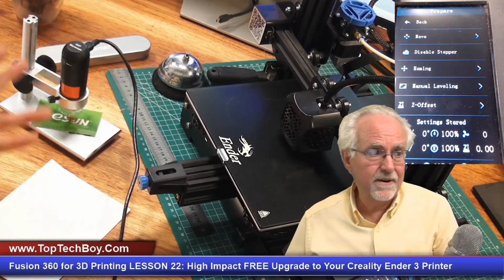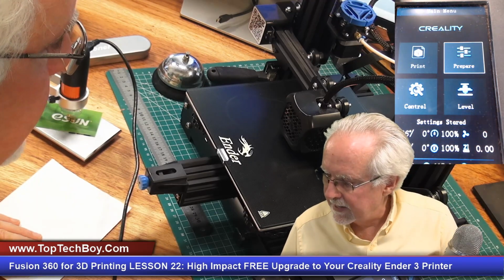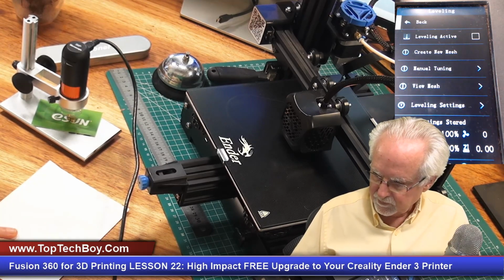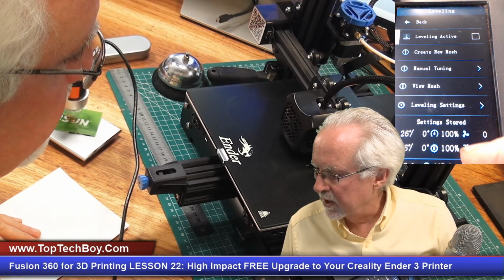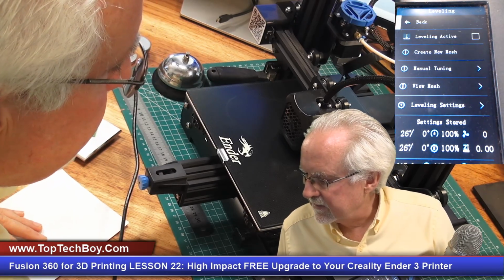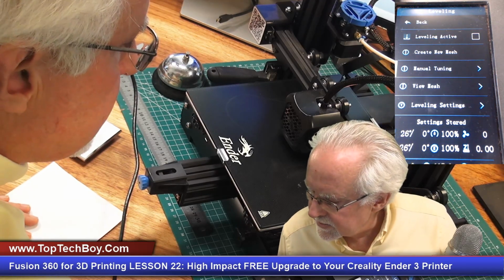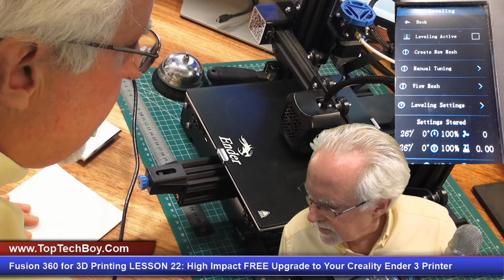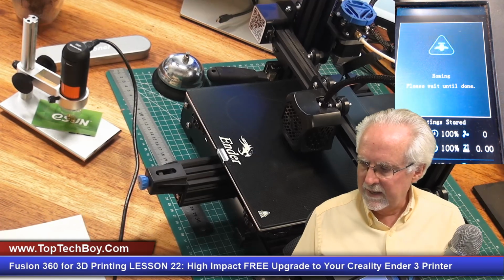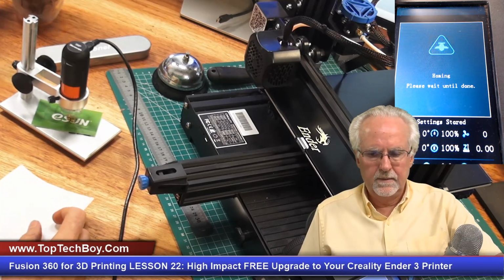In fact I don't use that, but I was just showing you that it is there. So we're going to go back, and instead of Prepare, we're going to come over here to Level. All right, now what do we want to do? We want to make leveling active. Okay, we'll make leveling active. I guess we have to make leveling active after we create a mesh. And so what we're going to do is come down and create a new mesh. Okay, create a new mesh. It says it's homing, so we'll wait for it.